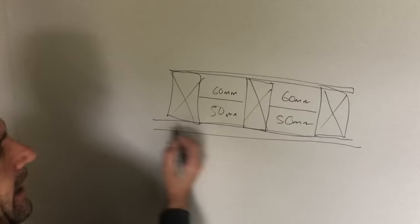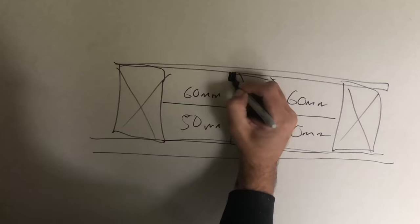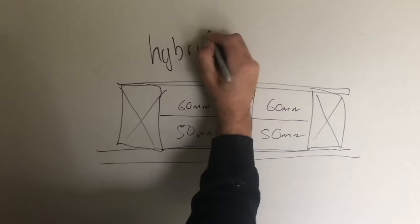So that's going on the roof and the walls complete. And then we will put our plasterboard there. There is no air in this cavity. Our cables are tacked tight to the side of the joist. The insulation is then cut around the cable like that. So there's no air in this cavity to condensate. Therefore, it's not going to condensate. Therefore, it doesn't need airflow. So that is your hybrid roof, right? You've got to do that because of the 2.5 so that you don't have to bend down.